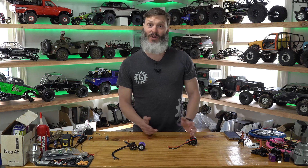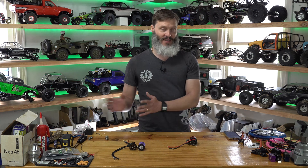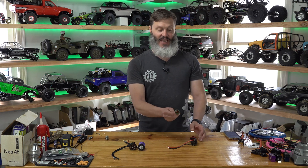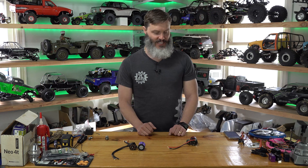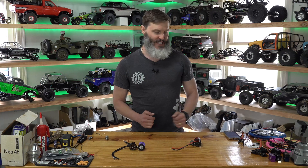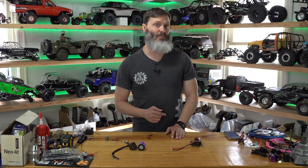On the upside, brushed motors are relatively inexpensive. Something like this sport motor you can get 500 miles out of — it's maybe even too good of a value for a $20 motor. Although you can get extremely expensive high-quality brushed motors. We do wind them in-house; this is a hand-wound armature. It takes a lot of time but it gives you better torque and efficiency. For the most part a brushed motor is the inexpensive easy device that comes in pretty much any ready-to-run vehicle.